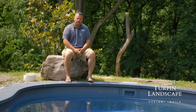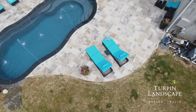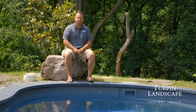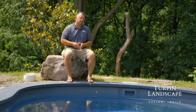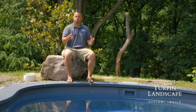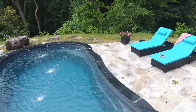One of the things I'm going to do is actually seal the patio and the coping. It gives it a really nice wet look when we do that, makes everything shine. But when you install something with concrete, there's something called efflorescence, and that efflorescence needs to come out of that concrete before we seal it in. So I'm probably going to seal this late this fall or early next spring.